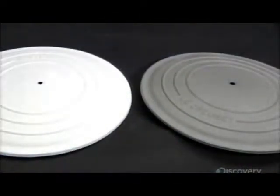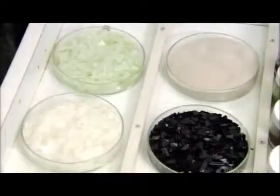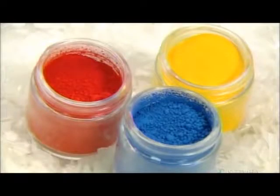After a trip through a dryer, the enamel goes into an oven at 850 degrees Celsius for about 45 minutes. During this firing, the hair-thin enamel coating becomes translucent. The second coat of enamel completely seals the porous surface. It's made of some 20 components, including enamel chips, pieces of clear glass, and pigment powders for color.